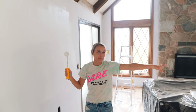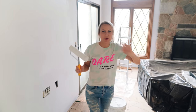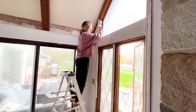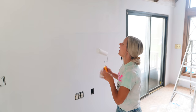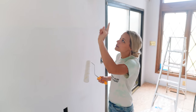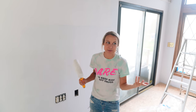We are rolling the great room. We couldn't spray in here because we wanted to keep these beams natural and also the fireplace — it would have been just way too much to tape off. Parts of the house we sprayed, which makes super quick work, but parts I am rolling. I decided to paint this strip of cedar going around because it stopped your eye from going up to the ceiling. Jamie sanded and skim coated it for me, and once we caulk and paint it, I think it's going to look a lot more seamless and bring your eye all the way up.